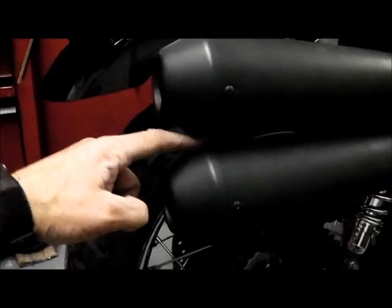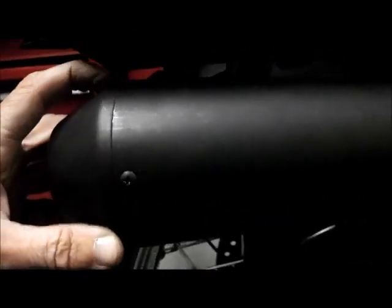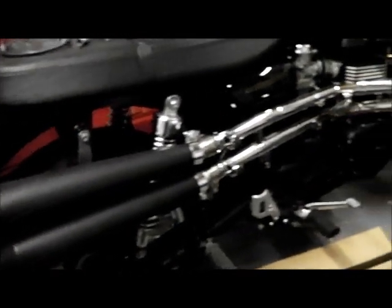but then they already are only half an inch apart, which is correct, and they ain't getting any closer together because they're bolted through holes, not slots. So that's great. I've got that fitted with no slots. Everything's on proper holes. I've just got to get down here, cut the bottom of that off, tidy the bracket up, make a good job of it, and that, I reckon, will be it for tonight. Dry fitted.